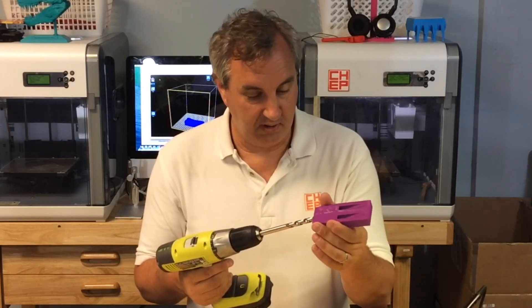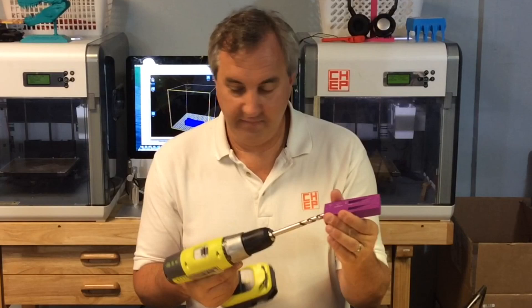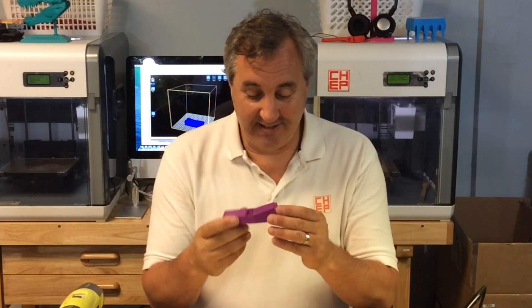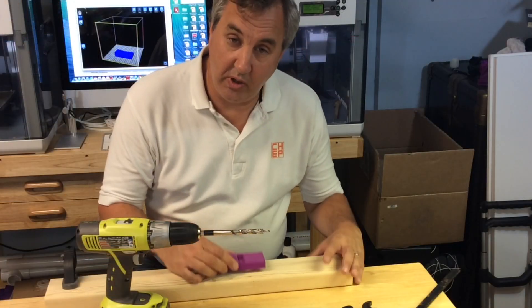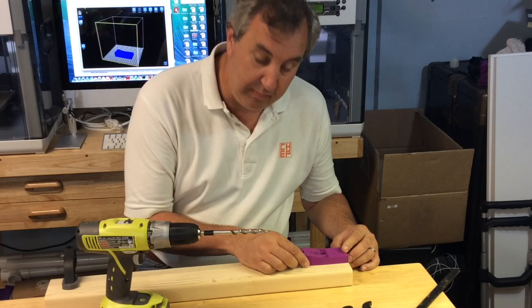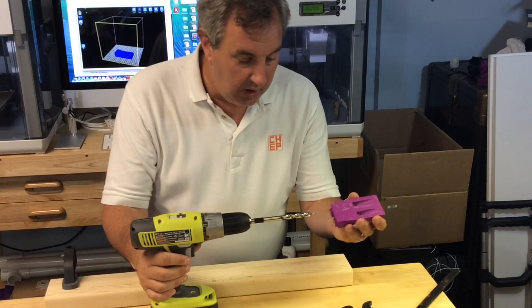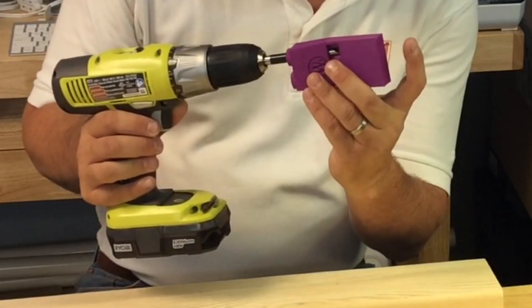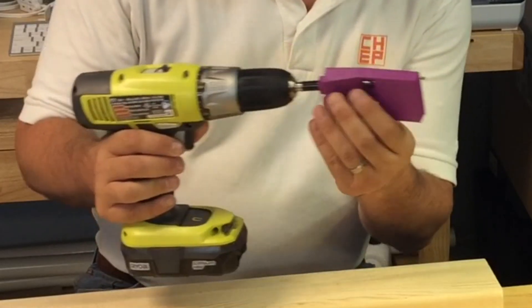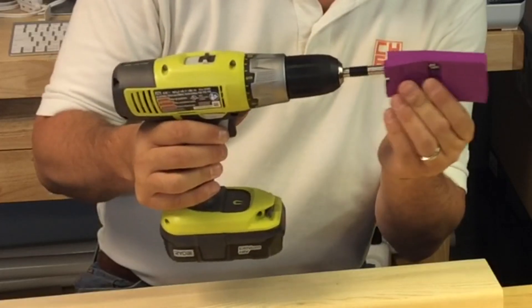This should be interesting to see how well this works. That looks as good as some of the stuff I've seen in the store — this is really a nice design and it cost me maybe two dollars total. Now we've got to test it out on this piece of wood. I got a piece of wood clamped down and I'll put the jig right here and clamp it down. I wanted to show how I positioned this piece of tape — this is very important. When I run this through I only want the end of the bit to just go past the end of the block, so I positioned a piece of electrical tape right there and that actually stops it from going too far.